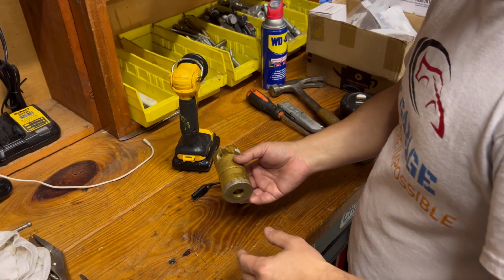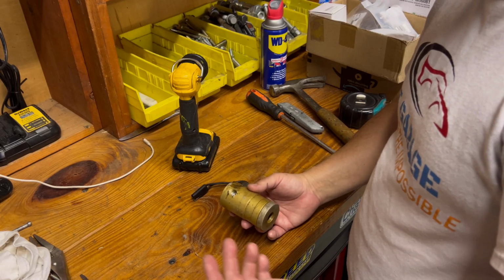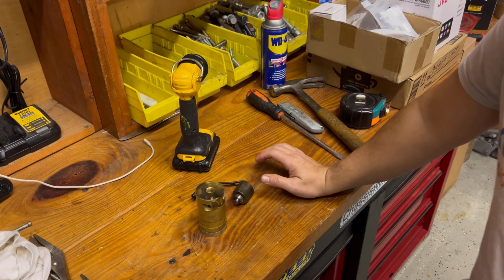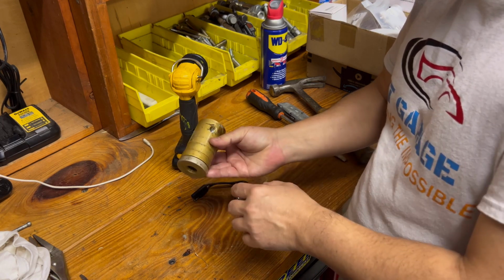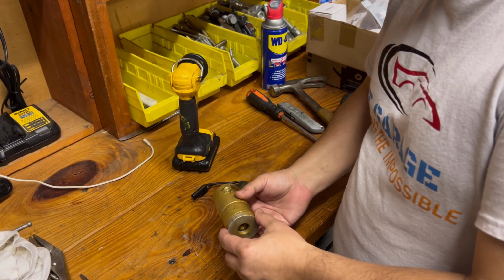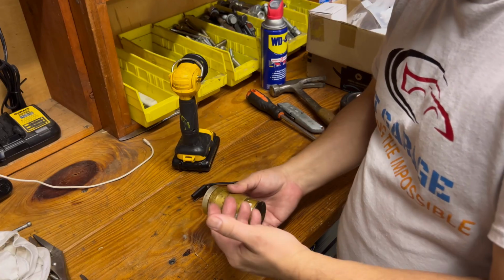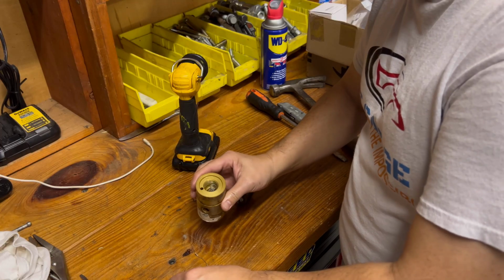At this point, I think the system is designed to go up to about 400 or 500 psi, which is a lot to me. But I think it's working properly because I couldn't find anything wrong with the system. And the pressure regulator is controlled by the spring, which is mechanical, so it can't go wrong. So maybe my hose burst just because it was old, but I'm surprised that they would build up over 400 psi. Anyway, I'm just going to reassemble and put it back in the truck. But again, reassembly is super easy.